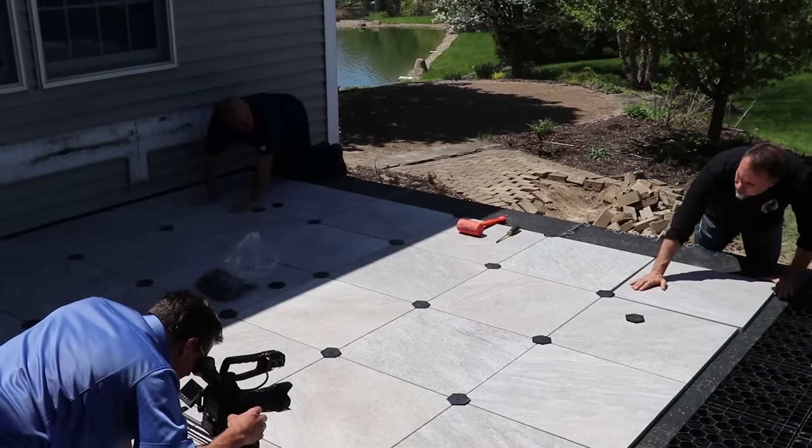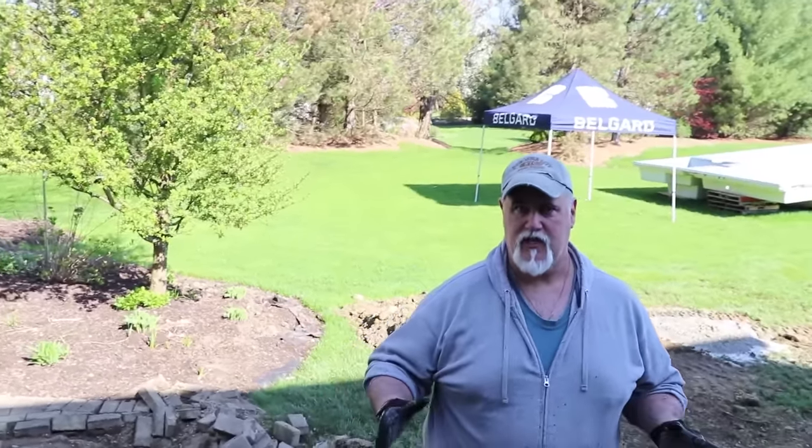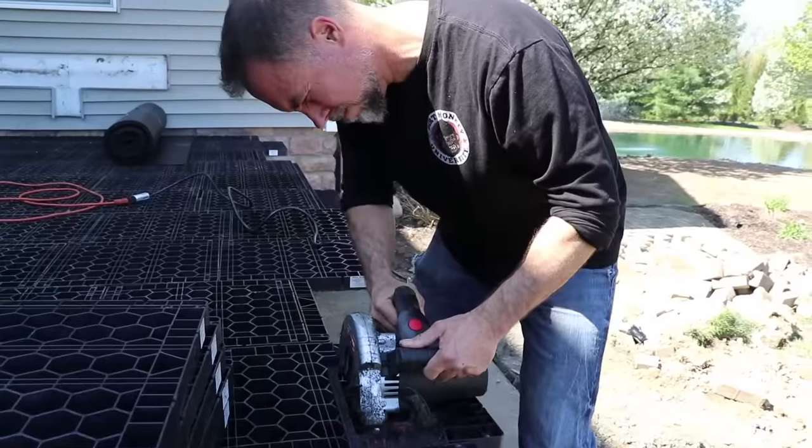The reason this works over, let's say, using plywood and putting a thin set down and putting a tile on, it's going to rot. No matter what you do, that's going to rot. Okay. If you decide to put cement on a deck with a tray, over time, cement doesn't flex at all, so as your deck moves, the cement will break up. It'll crack, right? This is designed to flex. You feel the flex?